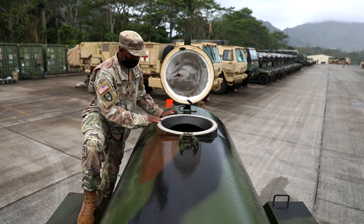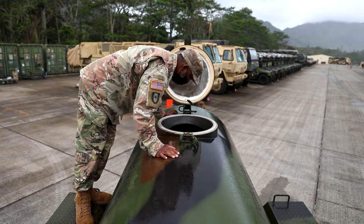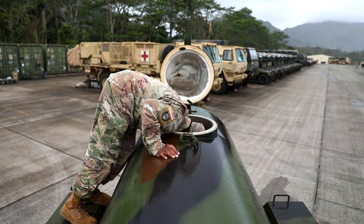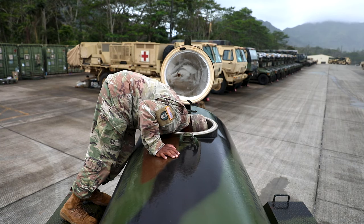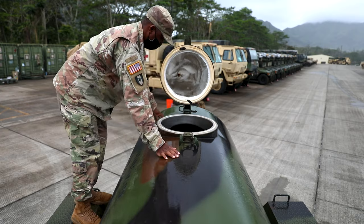From there we'll look inside your water buffalo, making sure there isn't excessive rust, no insulation showing, and no soil or dirt inside the container. We're also looking for that general smell of bleach, which shows us that you took the time to properly sanitize this container. If you do it in the way we're about to show you, you will definitely smell that bleach smell for a little while after cleaning.